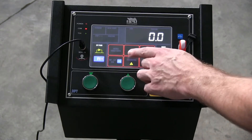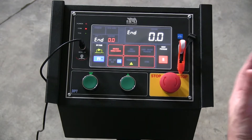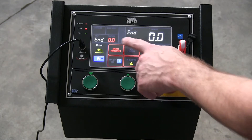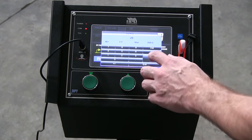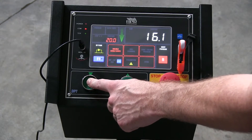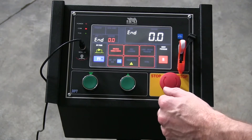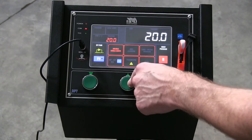I want to start on the left — enable single quote. This single quote position is for repetitive production bending, when you have one position and duplicate the same parts over and over again. Right now position is zero. I'm going to touch that and make it 20. The arrow is telling me to move down. It stops on 20 and now it says end, wanting me to go back up to the top. In this mode I can repeat this position over and over again.